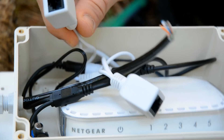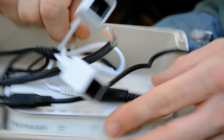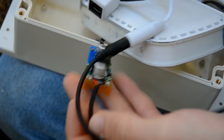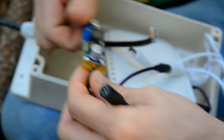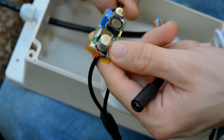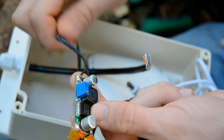The power and data come in from the main line but we don't want the power going into the switch ports. These are off the shelf — we had them shipped from China, you can buy them on eBay really cheaply, they're not very expensive. It has two wires coming from it: the power wire, which is just split out from the main connector, and then this goes to the DC/DC converter. We also bought barrel jack splitters off eBay — it takes in a barrel jack and splits it to two outputs.